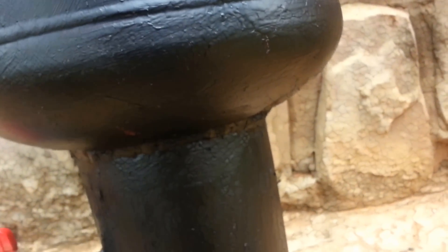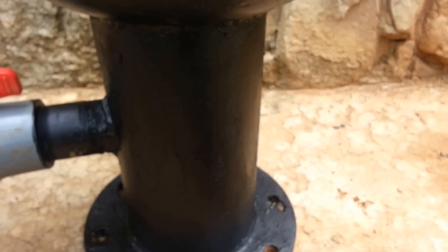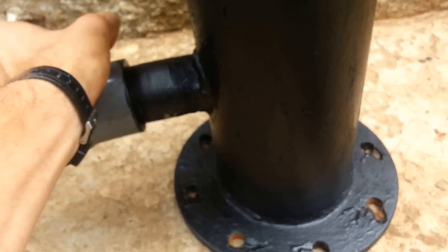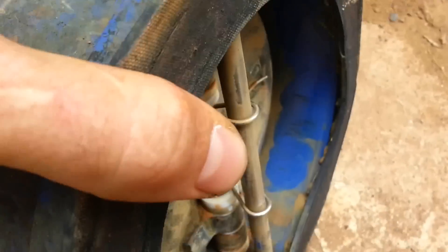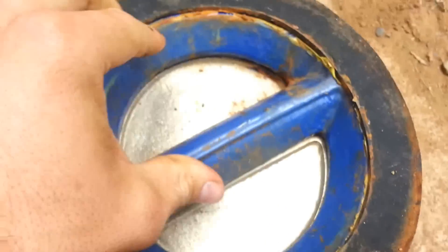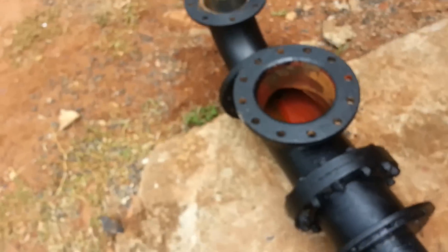Now this is an old fire extinguisher tank, but I welded an extension to fit on that end space. I made a hole straight through with the welder, then welded this on to adjust the flow. This comes in between as basically a non-return valve. You can see it's a non-return valve that fits on just here.